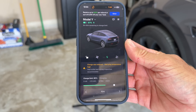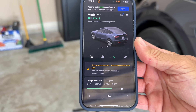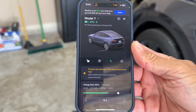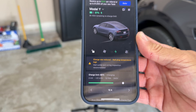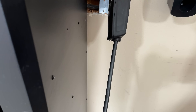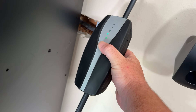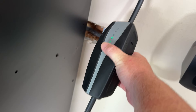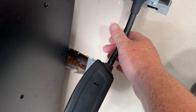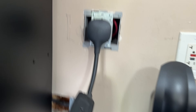This is the mobile connector trying to protect itself and the vehicle — that is what is happening here. We're covering today how to fix this, but also how to protect yourself from this happening in the first place. We have our mobile connector here, and I can tell you it is very warm. The box itself is very, very warm, and we're starting to get close to where up here it's hot — almost too hot to touch. So there's a lot of heat happening right now.